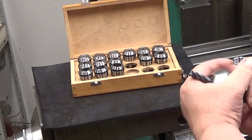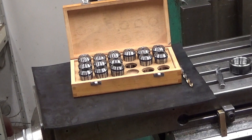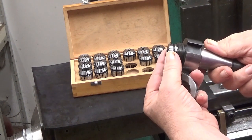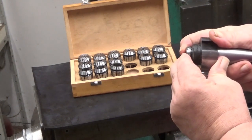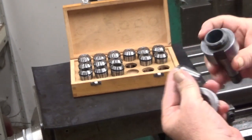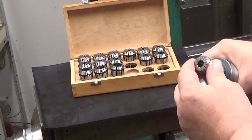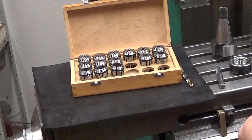So, the nut must be correctly placed, and sometimes, although this taper doesn't, it's on the edge of binding. Sometimes when it's down there, it doesn't pop up by itself. Therefore we have this eccentric part. It will pull the collet out from there. That's why you have it there.